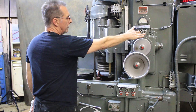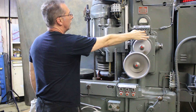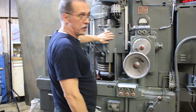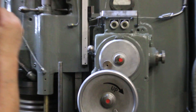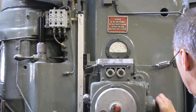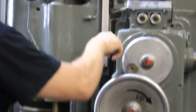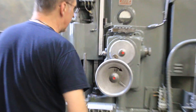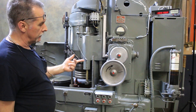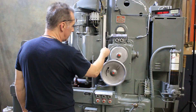Power up and down. The load meter does work — of course it's on zero because the spindle is just idling now, it's not actually grinding parts. We can turn our feeddown on. I'm going to set it here for somewhere in the middle — twenty-six thousandths per minute. Engage it, and it begins feeding, as you can see. It'll feed down to zero and stop.